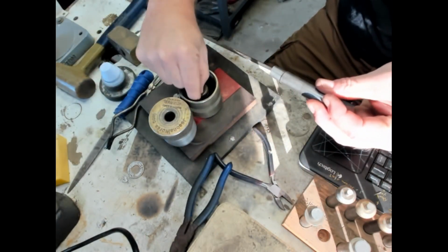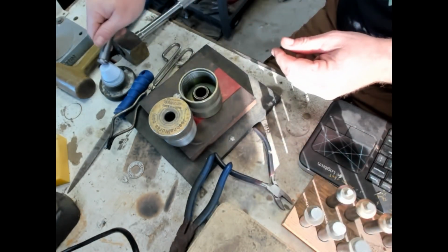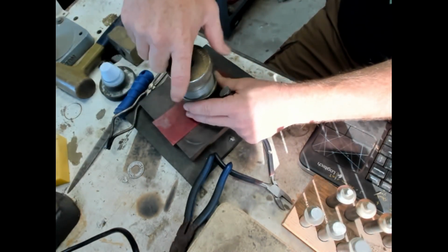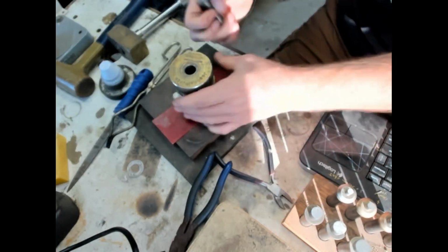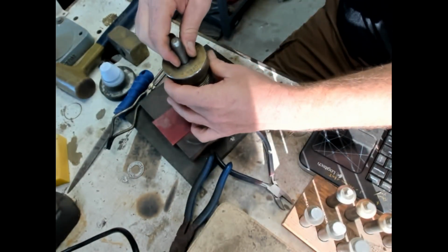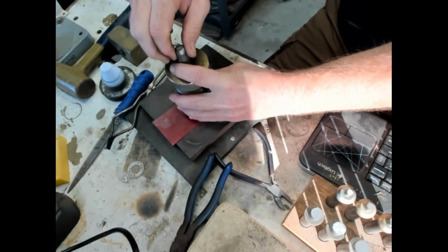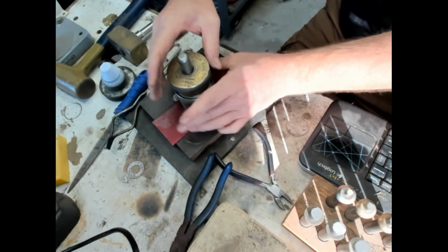So there's the first punch. Now we'll do the 3/4. Lay that coin in. Oop. Almost forgot, or I did forget. The larger punches go on the inside first. I'll start the thread and then I'll pick up on that punch just in case it moves that coin around off the pedestal on the inside, but we still got our space. Double check on the inside, we're good to go.